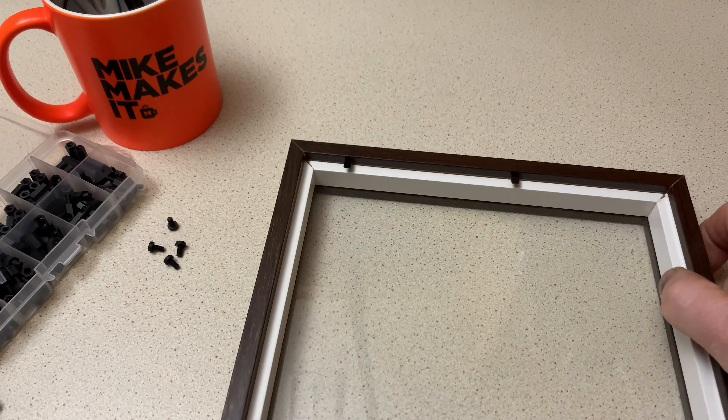We turn this over — the screws will stay in place. I'm going to put these on first, screw them onto the screws, just finger tight will do. Four of those, one each corner of the Pi. We're going to slide the Pi onto those screws, then put a couple of pillars on each of these to give a good space between the Pi HAT and the Pi itself. You've got an inductor on the back of the HAT and it does stick up a little bit, so you don't want this going too close. Seat that down now onto the pillars.